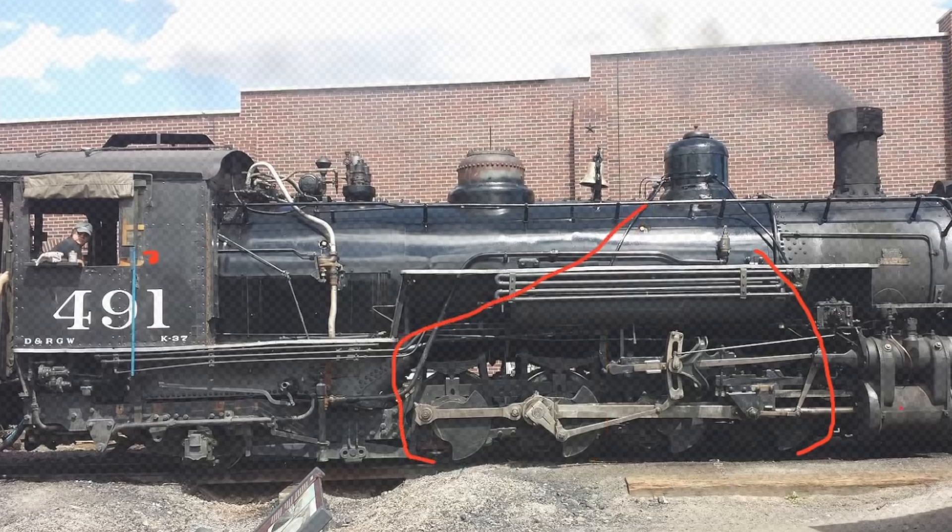We also have an air ringer for our bell — a little pneumatic cylinder inside the bell that allows the bell clapper to just sit there and hit the bell, which is why you'll hear some locomotives just go ding, ding, ding, ding. It's because it's air-powered rather than mechanical. Although some early locomotives also had a big pneumatic piston outside that made a swinging air ringer — they still sound like they're being rung by a cord, but they're actually being rung by a swinging ringer, which is a total pain of a mechanism to deal with.